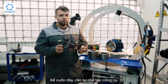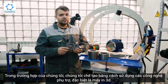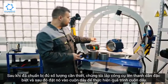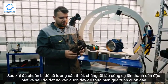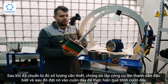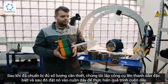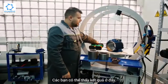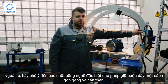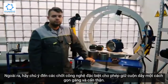In order to wind any coil, it's necessary to make the tooling itself. In our case we produce it using additive technologies — a 3D printer in particular. After having prepared the required amount, we mount the tooling on the special guide and then place it in the winding unit to perform the winding process. You can see the result here. Also pay attention to the special technological pins that allow us to keep our coil in a neat and careful way.